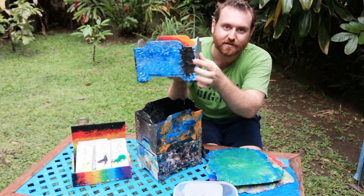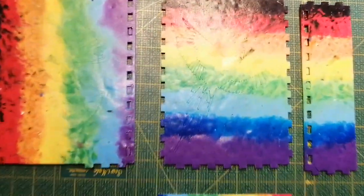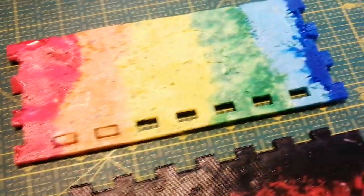All these boxes are based on the fact that they have little finger joints. When you're working with our funky plastic, you're going to want to make these finger joints larger, fatter, thicker — and also a little bit more forgiving.